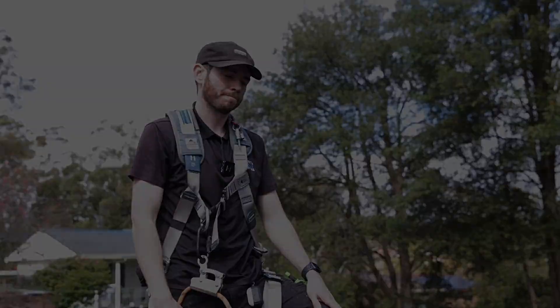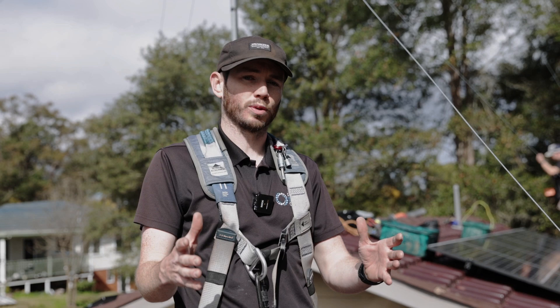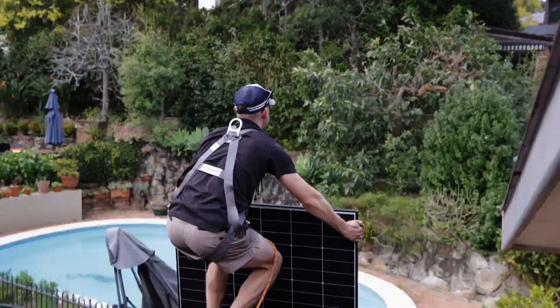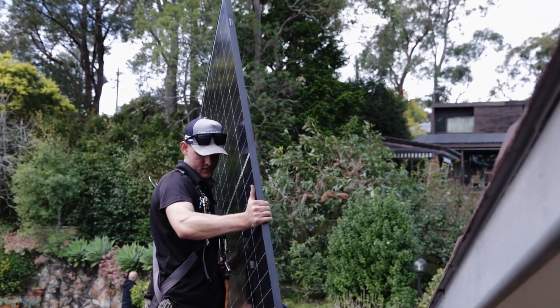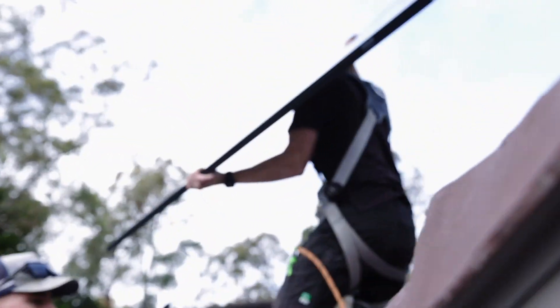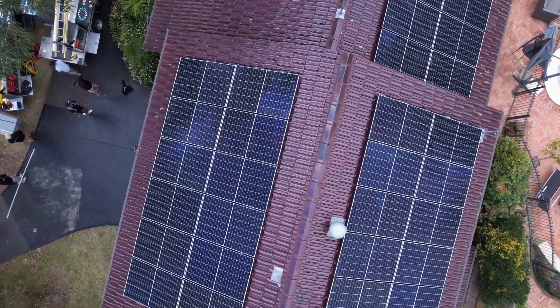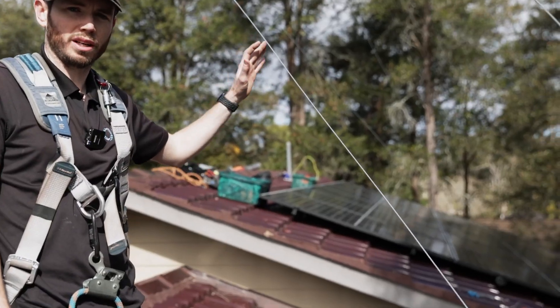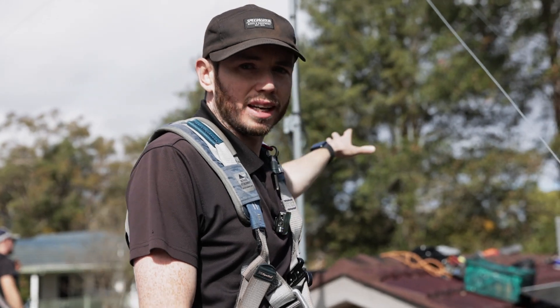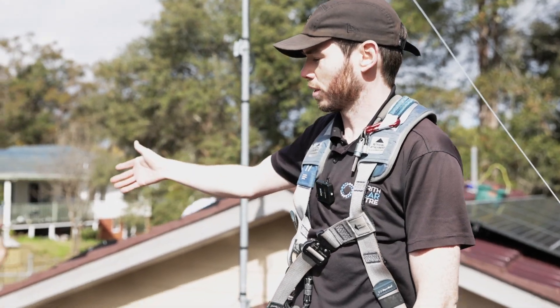It's super important to have spare tiles, because when we're walking panels on the roof we're about 20-plus kilos more, and everywhere we step we could break a tile at any moment. When we have spares we change them out straight away, keeping the roof sealed and secure. We've got three roof faces today — the one behind me is complete with six panels, the boys are carefully laying the back face, and the last face we're about to throw up now.